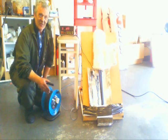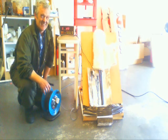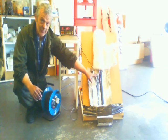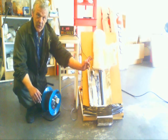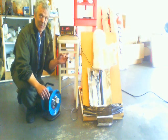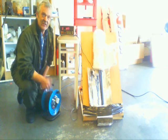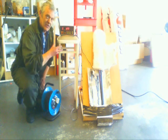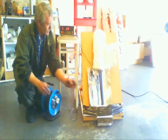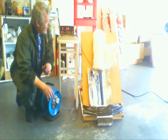Then I put that in the sun. We don't get much sun in England — we've had about 20 minutes. I've got four probes on it measuring the internal temperature of the tube, the internal temperature of the heat pipe head, and the external temperature of the heat pipe head as well. I've wrapped insulation around it because I want to see what amount of heat it will transfer — I don't want to lose that heat to the surrounding environment; I want to see what it will get from here and put into the head.